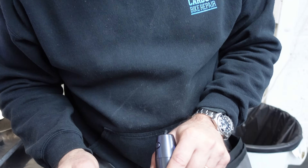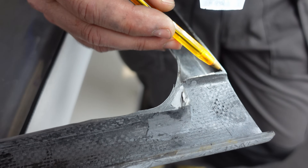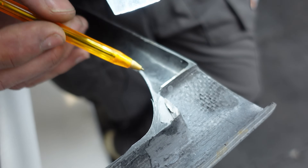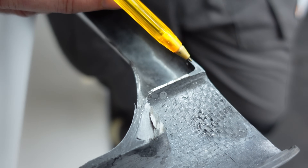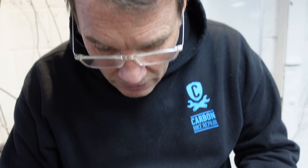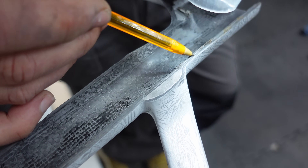One thing I have noticed — they've been quite conservative with the design in terms of radii. I'd never like to see carbon where there's a square end. You can see there's a small radius on there — it's very important to have radii on these. When you've got a square end, you've got a potential of fracturing on that corner because there's an instant density material change. Whereas with the radius, it gives the carbon enough time during its flex process to handle the change in the density of materials. A dead end square cut is never good — you always get fractures on those edges. This is all very much part of the aero design but these are all very important and play into the behavior of carbon.